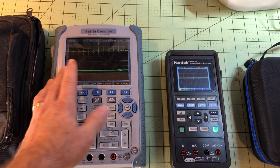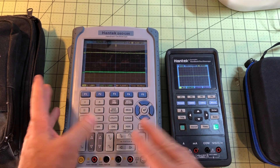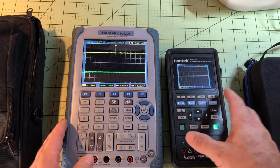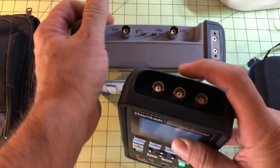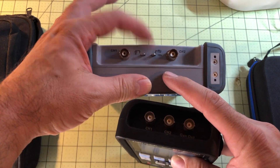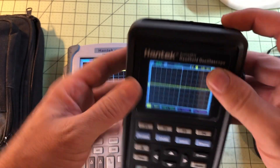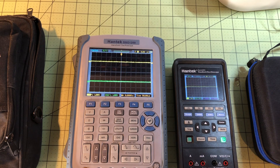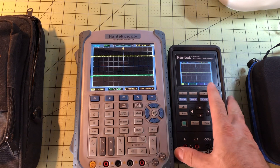You can see this is the one I have — I own both of them, but this one I've been using for quite a few years. Obviously there are a lot of added features on here, bigger screen. Clearly both of them have two inputs. This one does have a reference waveform of one kilohertz, and this one has a generator output you can buy as a feature — so for plant repair you can use it, like triggering a three-phase inverter to operate. But overall that's not all that useful in the field.